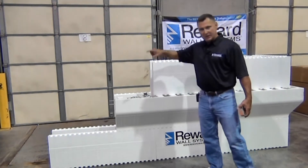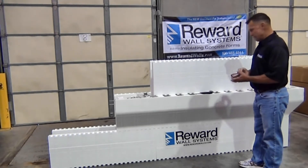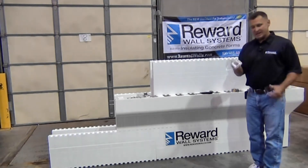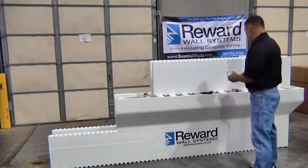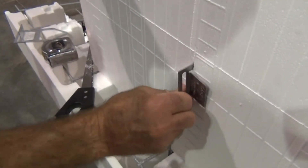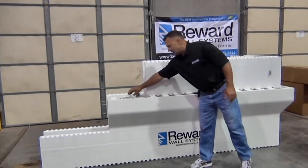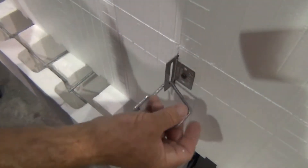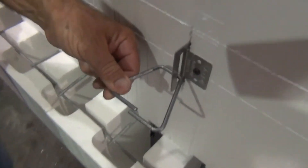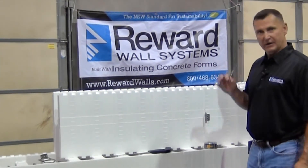On my next coursing I'd come up 16 inches, again right in the middle of the form. Then I'd come back through and place my tie key, which has a flange that will butt right up against where the tie is, and push it into the form centered on my cut line. The tie key gives two inches of adjustment for a triangular wire tie, which is readily available from your masonry supply center. These come in different sizes and are installed when the masonry contractor comes to put the veneer onto the wall.